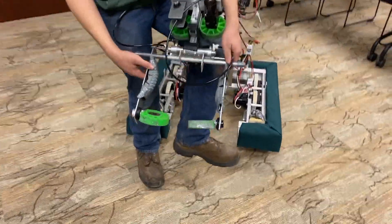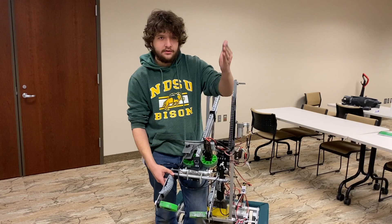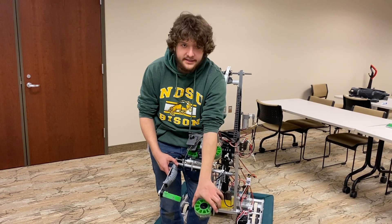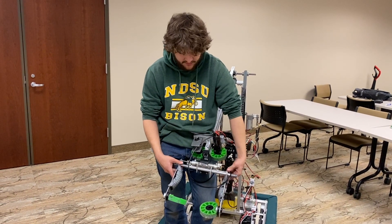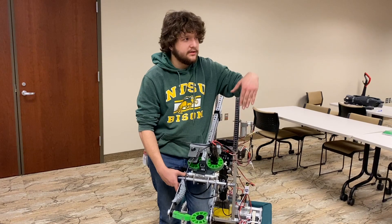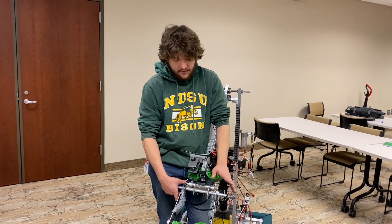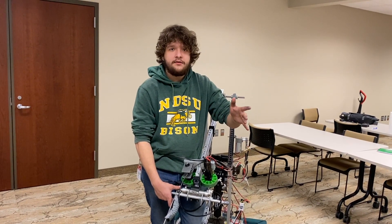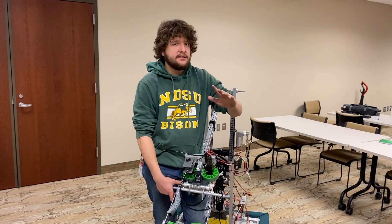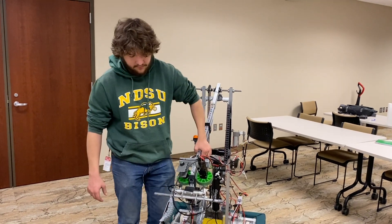Our green compliant wheels are mounted on ball bearings that can freely spin. Ball bearings really like radial loads — up and down on the shaft — so they can support weight all day and still spin freely. They don't like side loads, which is what we're applying here, and with pneumatic pistons we're pulling a couple hundred pounds of force on those. To get around that, you can soak the bearings in WD-40 to remove grease and loosen them up, or buy bearings designed to support side loads better.